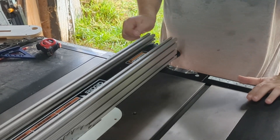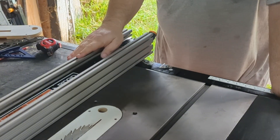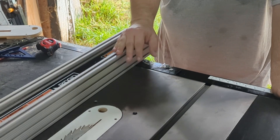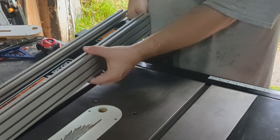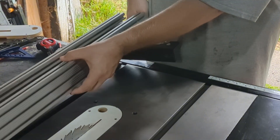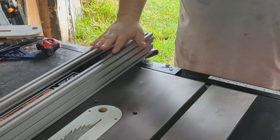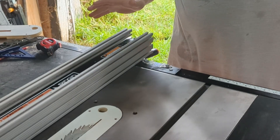After a bunch of fussing with it, I got this one on. A couple things I think I would change: I would do the back one first, and once I got that on, try to drill the holes all the way through - maybe even use a drill press to get them straighter. I had to adjust the holes and eventually got them big enough. I also figured out that it just has to be leveled with the bar on the bottom - I was trying to use the cards and all that, but basically leveling it up on the bottom is the straightforward easiest way. So now I've got it on here, it doesn't hit as it slides, we're good. We've got both sides on and I'm going to leave them right here - I brought them right to the end and it's past the back, so we're good there.